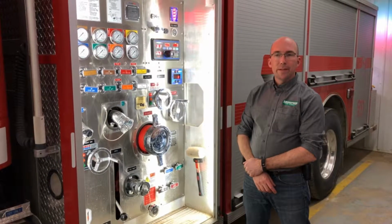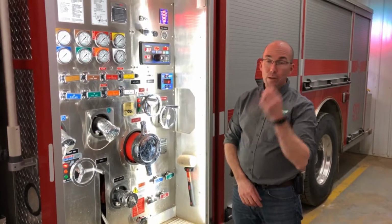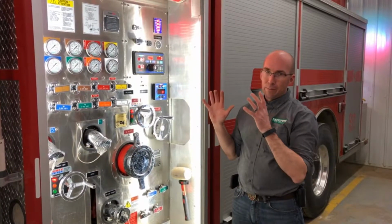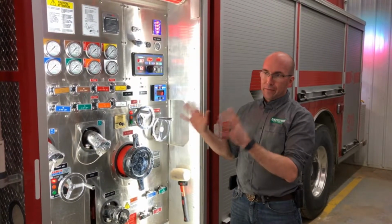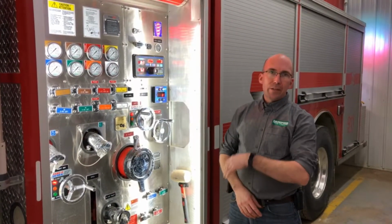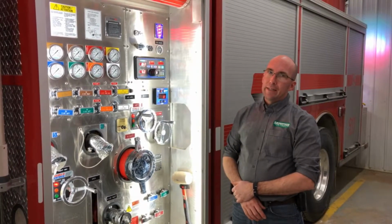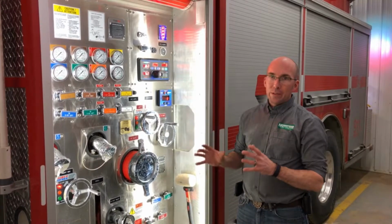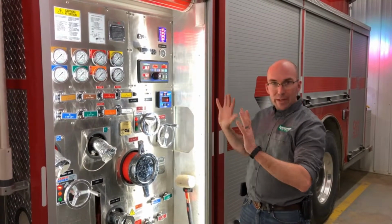It's Jacques from Melfab. Today we're going to have a little bit longer video than what we usually do. We would like to talk about how to completely drain a fire apparatus if it has to go out for service, if it has to sit outside for an extended period of time. We want to make sure that you remove the water out of everything.